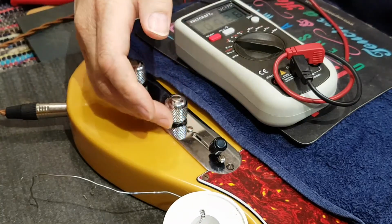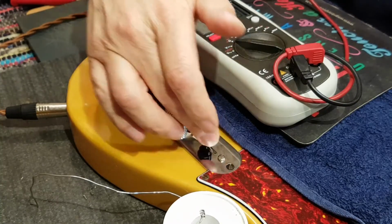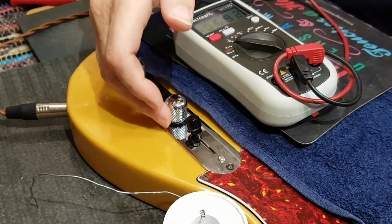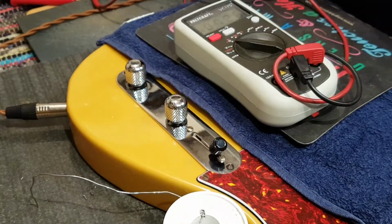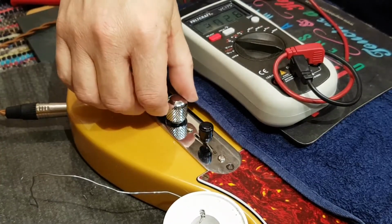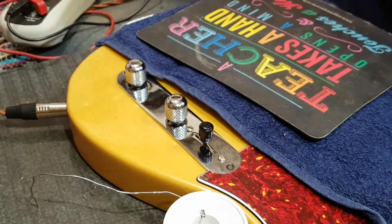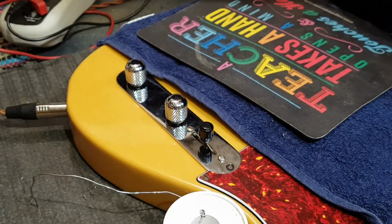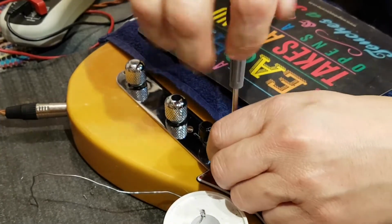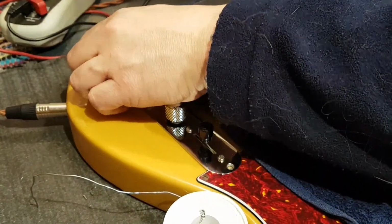That means that what I was thinking is correct. That I still need to link up my two. See, that's 6 kilo ohm, which is also correct. 7 on the neck, 6 on the bridge. And in the middle, we ain't got nothing. All we get is the volume control. So, my confidence was incorrect, and my gut instinct was right. That there needed to be something else. Sure, this is turning into a long video. Oh well. Let's get it out.